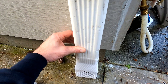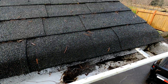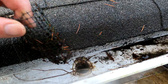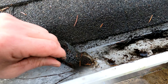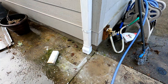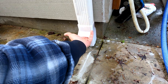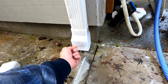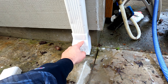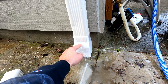That's a nice fit — perfect. This is what was in there before, and the problem is this just clogs up way too quick. We're going to deal with this small gutter drop size in a future project. I've got a garden hose running in the gutter full blast, and I see a problem with my design here. I might have to add some kind of stop in here to prevent this water from running down the face of this.